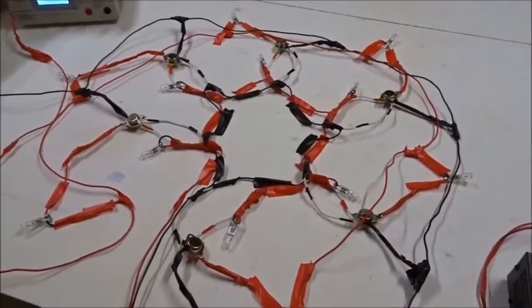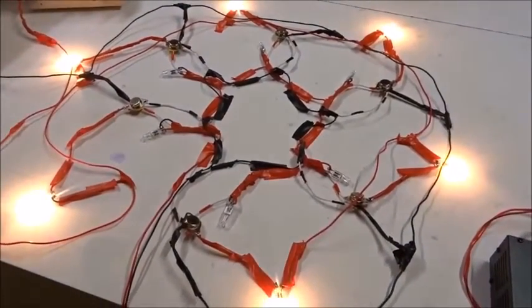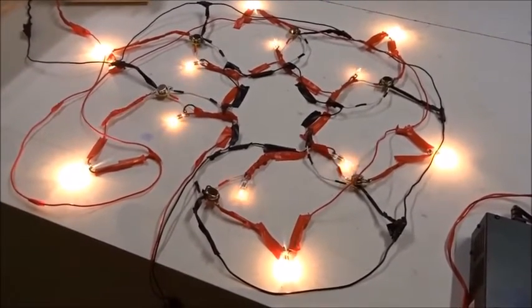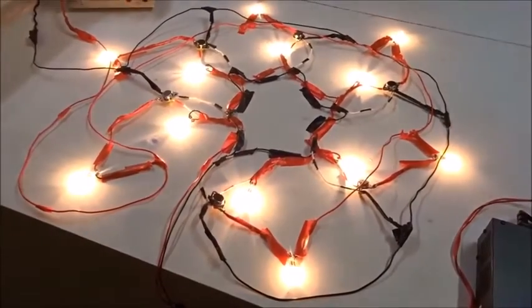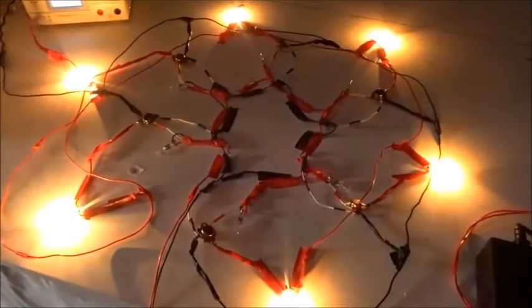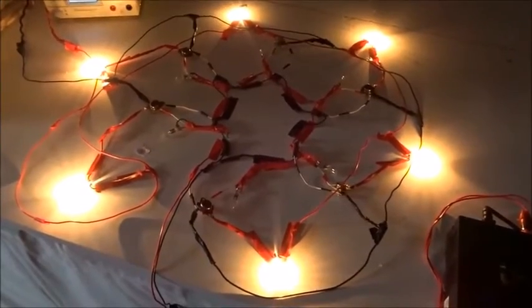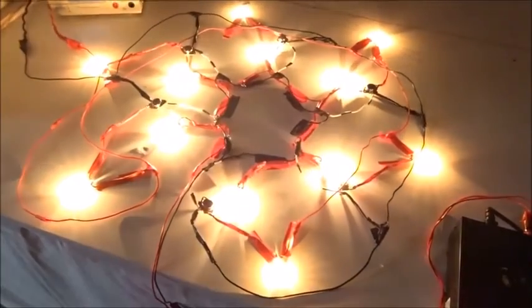Let's watch how that happens. Very cool, isn't it? We go a little higher on base currents — you can see the inside light up as well. Here we are under slightly darker conditions. We still have six volts going into the collectors and emitters, no current yet. And here's the base currents coming off this power supply — we're going to reach 0.7 volts. Watch what happens. Beautiful, isn't it? It lights up like a six-pointed star. We go to a little higher base voltage, and the inside lights up as well.